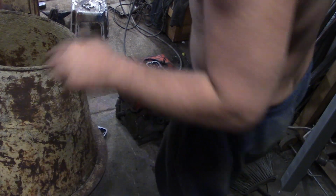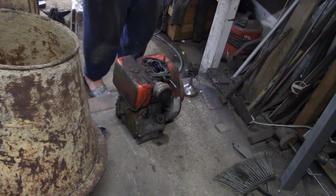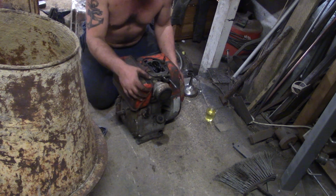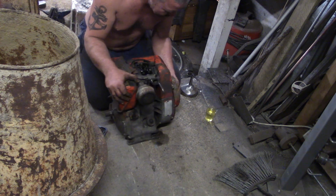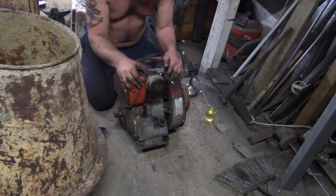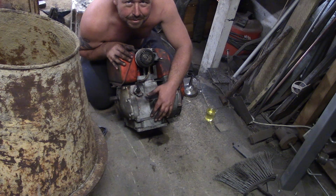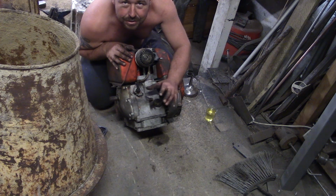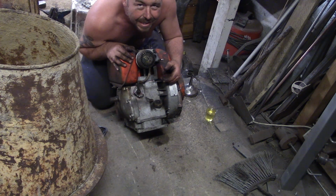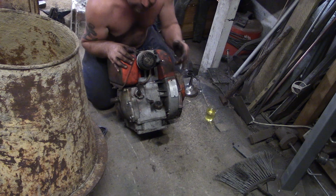Okay, Jimmy's top tips on unsticking an engine there. It's pretty rare that I have to do something like this, because if someone's left an aeroplane so long that the engine's seized, it's an overhaul job, not a scratch the damage out with a bit of emery cloth, but all the same. I've already got a load of Kero in the bottom. I don't have enough penetrating oil to throw it in here, so I've got kerosene in the crankcase and sloshed that around, turned the engine upside down so it gets on the oil control ring. Oil control ring's at the bottom. That's the delicate one, the one that's most likely going to get buggered up when we try and turn this thing over. So that's important, getting it both sides of the rings.